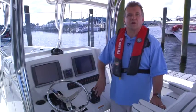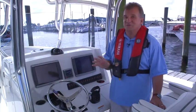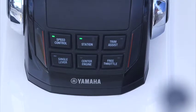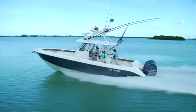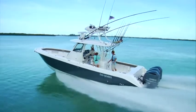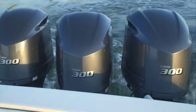On the front of the control are six push buttons, each controlling a different function — this is where the magic really is. On the upper left is the speed control button. Pushing it locks your current engine RPM, similar to cruise control on your car. But unlike your car, it can be activated at any RPM, from in-gear idle all the way up to near wide open throttle. This is particularly useful when trolling or running in the mid-range for long periods of time.